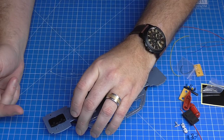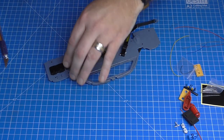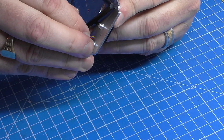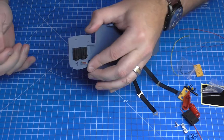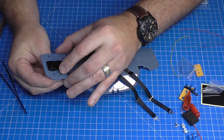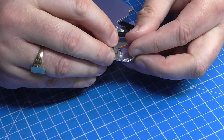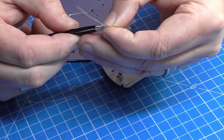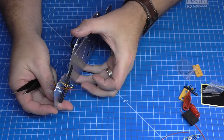It's not the two at the very top - it's the two just underneath. I've twisted the ends to help get them in. They're all in there now. I'm going to pull through so it's half and half each side, because I'll need that space when I put these into the fuse box. I'm folding them down to do exactly the same on the hole next to it. I can always get four through at one time but never the fifth, so use tweezers right close to the end and gently push that through.